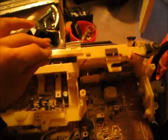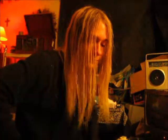When it comes to dial strings, I'm not really too clever, but I'm going to remember that there are three turns along this rod — the string is turned three times. It comes up here to a wheel, goes along here — this right here is your tuning selector needle. Keeps on going down to this wheel and down there somewhere. Once I take this plastic thing out, the dial strings are going to disconnect and get loose. I'm not positive I'll be able to get these dial strings to work. The last time I tried working on dial strings they worked for about two days and then the string snapped.